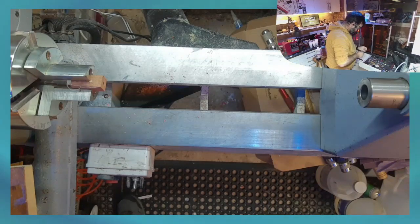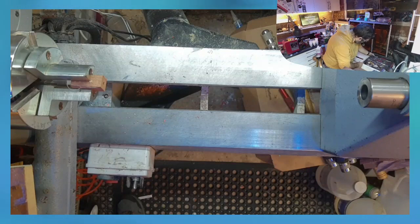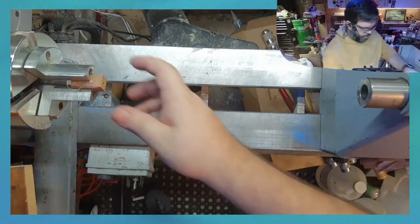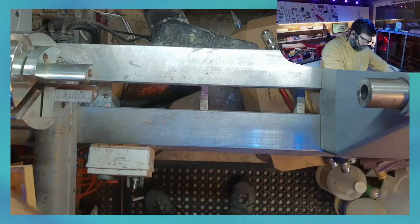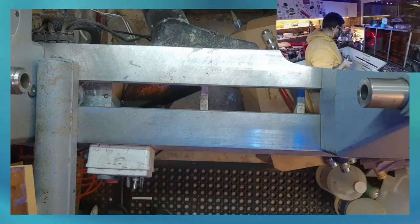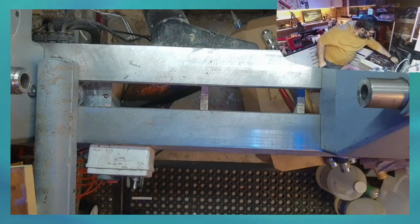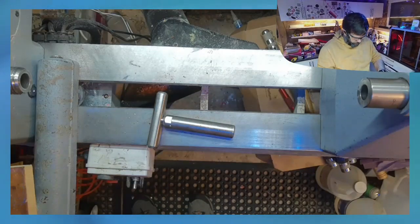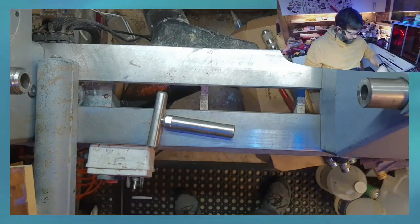Sleeve a 4mm drill bit. One dead, one live. Dead center. Live center. Removes the chuck. Got the small tool rest out. Just stack those at the end of the lathe.